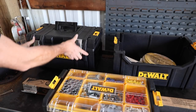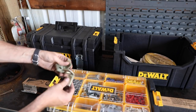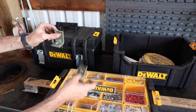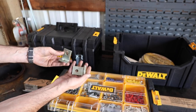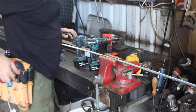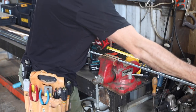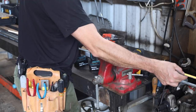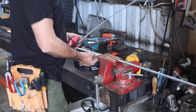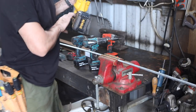To mount the all-thread to the top, we'll use these caddy brackets with half-inch lag bolts, and then our all-thread will go down through there and hang. Those are definitely going to be strong. I'm going to hang the LED strips from the all-thread — this is half-inch all-thread, just a round threaded rod that's threaded the whole length. It gives us lots of adjustability. This is a 10-footer and I figured about five feet off the rafter is what we need.